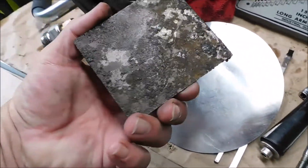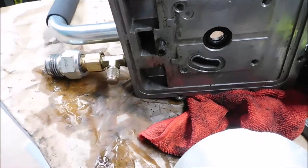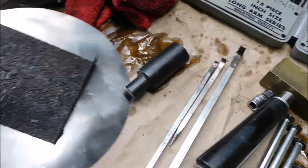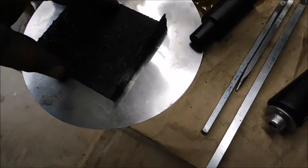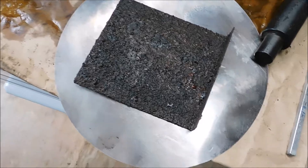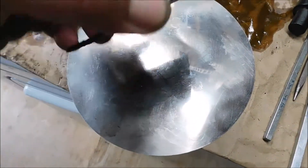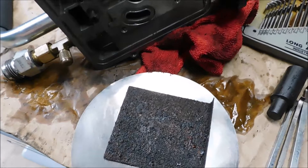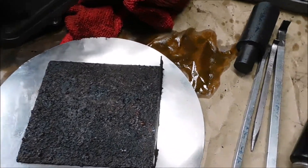I think I'm gonna make a new plate — it's just a splash guard to keep oil from going up the out tube, the exhaust. I think I can make something out of this; it's a little thin but it's just a splash guard, so it can't hurt anything. That's what I'm gonna do — make one up, bend it, put it in there so I won't have this rust problem getting down into my pump. Can't be any good if it gets into the vanes.